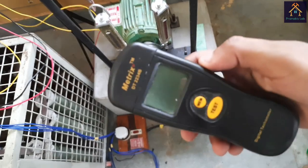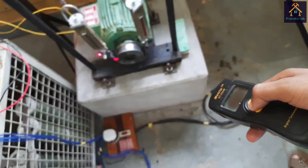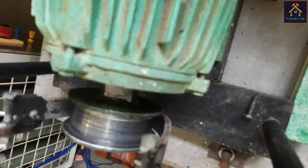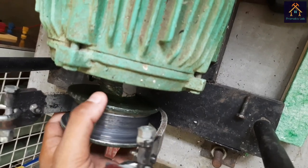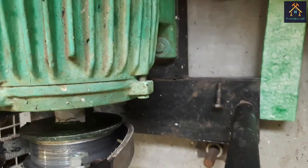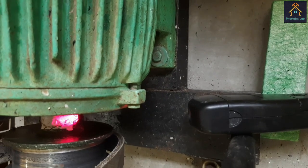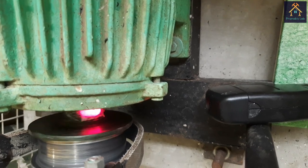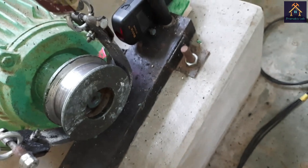And we will use this non-contact type laser tachometer for measuring the speed of the motor. And you can see there is a white color tape stuck on the shaft of the motor. It will sense the rotation of the motor in RPM. Just like this, we will hold this tachometer in this position, and it will measure the speed. And we have to keep a water bottle filled with water for pouring water into the brake drum